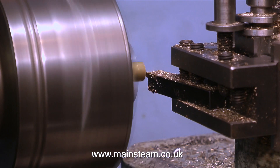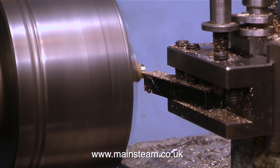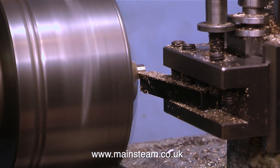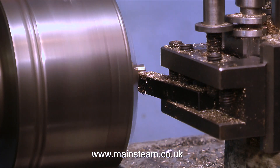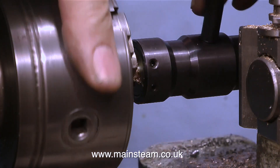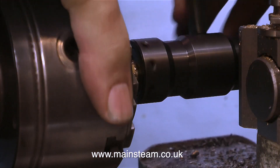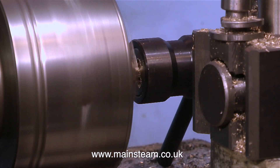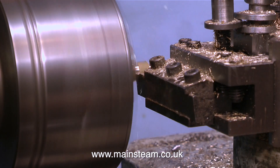What I've figured out is it's more or less the same as the threads I use, except the pitch is just slightly wrong. It's a similar thing to the problem I have with PM Research elbows, which are threaded quarter by 40 - but the American quarter by 40 is not the same as the British quarter by 40. Most of these threads are going to fit into the boiler perfectly fine, and I'm not having to use any special sealant other than a bit of Loctite 542 in the normal way. I'm quite pleased about this - I wasn't really looking forward to making metric threaded boiler fittings from scratch.